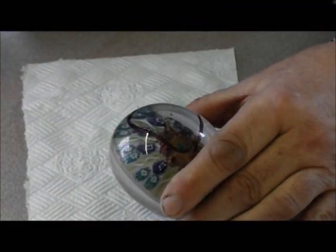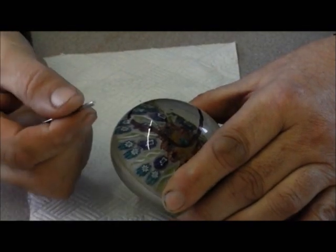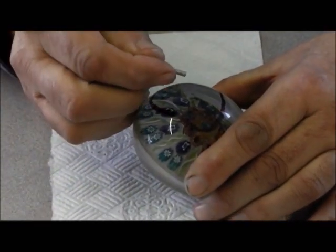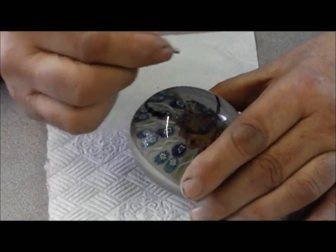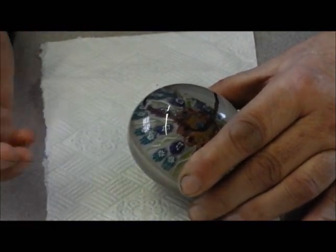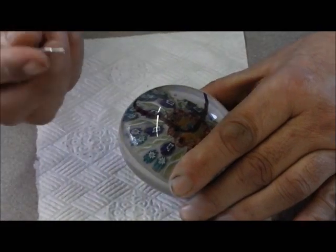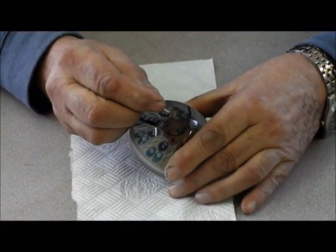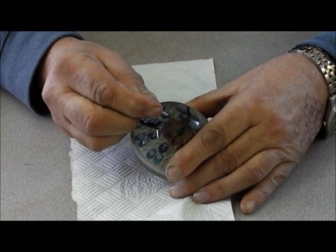What I'm going to do during the process of doing this chip — I've got a little diamond point here and I have my Dremel set. I'm just going to put a light scratch across the top so that as we go along I can take that scratch out first, just to show you — if you've got a paperweight with just a light scratch — how quick and easy it can be. So with this diamond tip, very slight pressure, I'm just going to put a scratch across there.